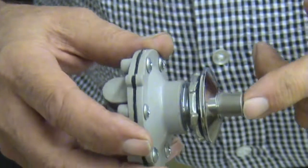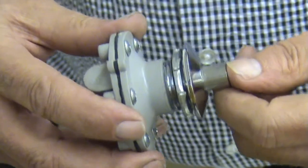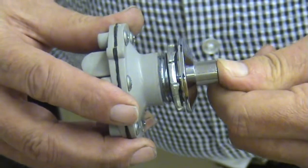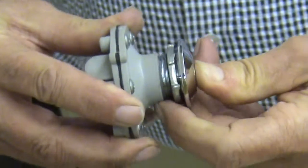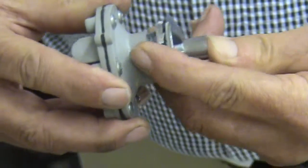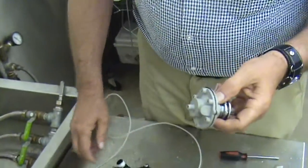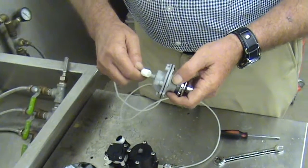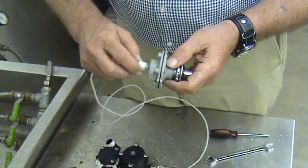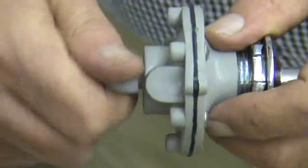It's always advisable to screw it all the way on until the shoulders meet — that way you get the most effective actuation of the pod. When you push the button you'll immediately start to push air out of the pod, and when you release it you'll pull all that vacuum back in. The most important thing is your tube connection on the back end — that must be airtight for this valve to operate properly.